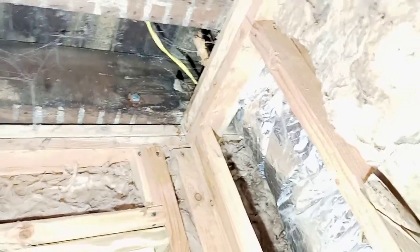You can see the old ductwork buried behind the wall. There's a lag screw up here — I'm not sure what its intent is, but it's not touching or coming in contact with the joist as far as I can see. So the joists are still pocket to pocket and that wall is non-load-bearing besides bearing its own weight.